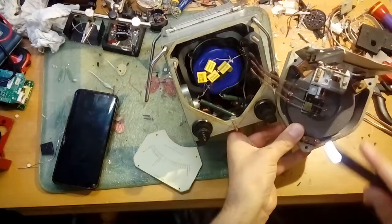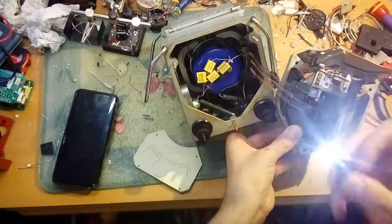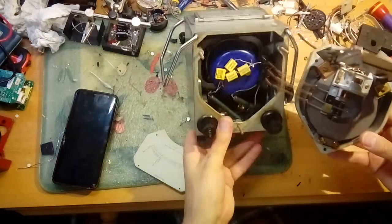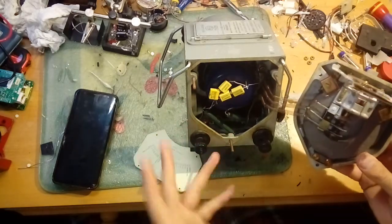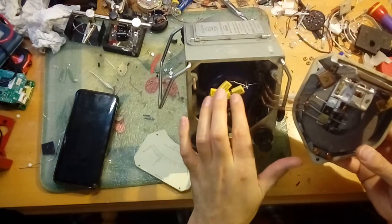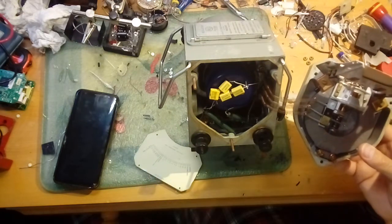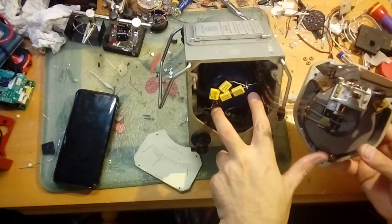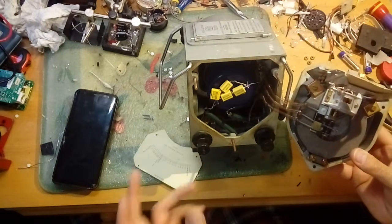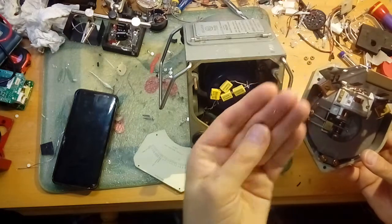Down the back - this is one of those situations where having an extra set of arms would really be useful. You can see those brown things - they turn out to be wire-wound resistors; I didn't know what they were when I first saw them, even ended up discussing it on Facebook groups. Here's your dynamo motor, and your main filter cap that filters out the AC noise from the motor, which actually went up to about 120 volts. Open circuit, this little dynamo will generate 550 volts.